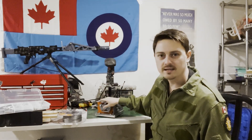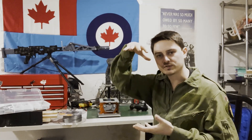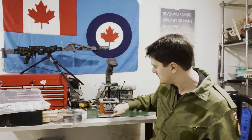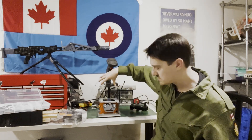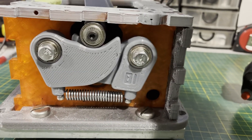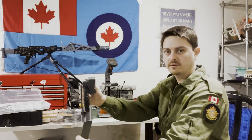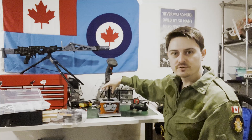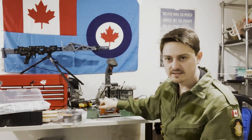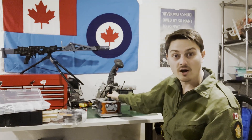The other aspect is for the design — I want to redesign it instead of using this box groove-slot system. Even though it's printed rather than laser cut, I want to change it over to a clamp clamshell, making it so that the cam sections are cartridges that can slide in. Some suggestions we've had include having the neutral position offset, because on a Spitfire control stick the forward position is actually vertical — it doesn't push forward, it stops vertical and then pulls back. With that cartridge system, without reprinting a huge component, you just slide it in, put bolts in the top, and the neutral position of the cams is offset for different designs.